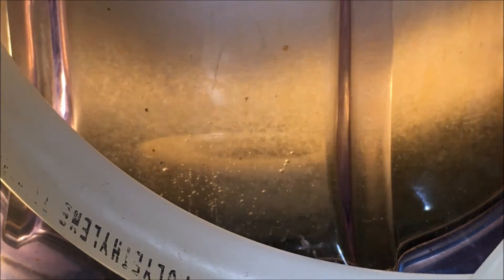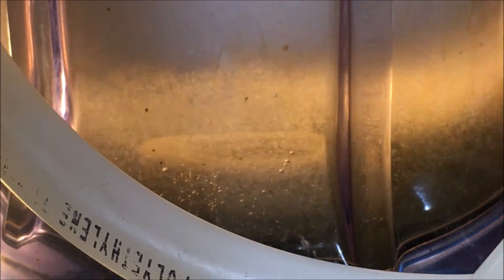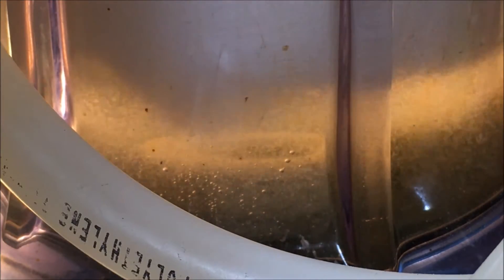The ultrasonic transducer installation was a definite go — definitely a well-advised decision. I've tried putting screens and a bunch of stuff in there, but you don't understand how small some of those bubbles are. They pass right through some of the smallest screens. These are not your typical bubbles — these are electrolysis bubbles. Some people even say there's something called nascent hydrogen and nascent oxygen, meaning single atoms of the species. Those can be extremely small, making really small bubbles when they consolidate initially. We are making gas on the atomic scale here, apparently.